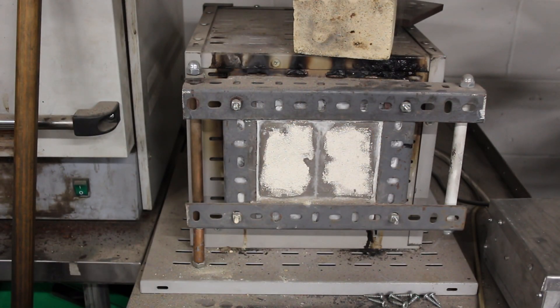Now we need to put it into a kiln. This is a homemade kiln I made about two years ago. Put the mushrooms in there, turn it on to 700 degrees centigrade, and just let it ramp itself up — it ramps quite quickly, sort of a degree or two a minute. Get it up to 700 degrees centigrade and then leave it for an hour.